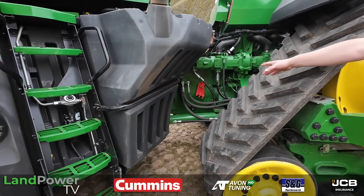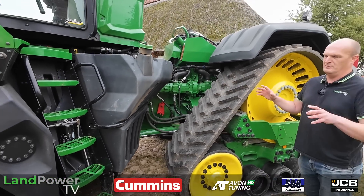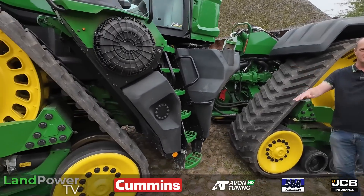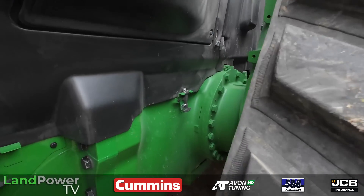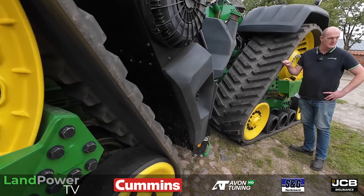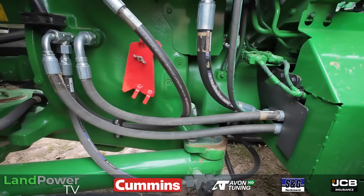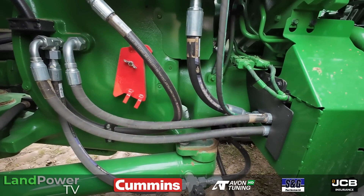Looking at the track layout, the tracks are bolted to the sides of the tractor — they're not across an axle doing left-right movement. That's all done at the pivot point, so there's a big pivot point down the middle. The actual axles themselves are fixed. The track units have some pivot front-to-back, but side-to-side they're fixed. So that pivot point in the middle is where it twists, effectively.